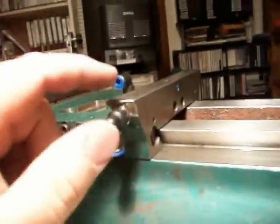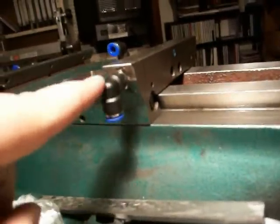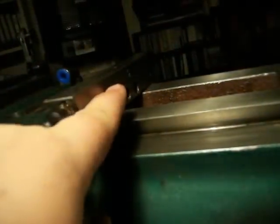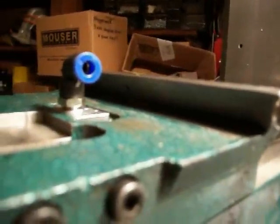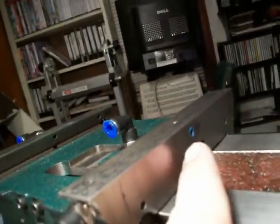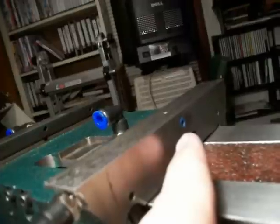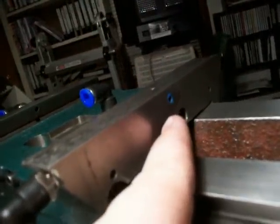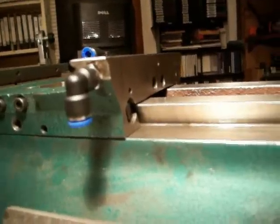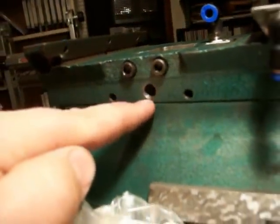The rear of the saddle is the only place where you really had to do much drilling. I drilled a one-eighth inch hole from the edge all the way to the center of the saddle, then I drilled a one-eighth inch hole into the back all the way through so it comes out the dovetail - that'll oil the dovetail. Then I drilled down from the top to intersect it and cleaned them all out. Then I tapped the hole in the back with 8-32 and put a little 8-32 set screw in there, loctited it. We need the back of this flush because it can actually bump up against the column. So now we've got that oiled with nothing interfering with its full travel.